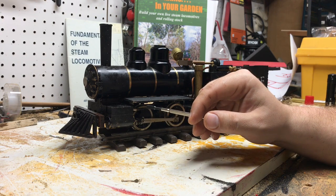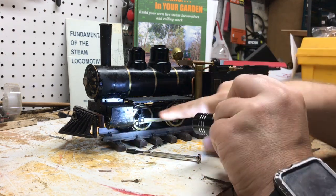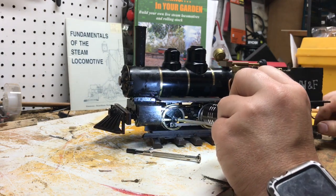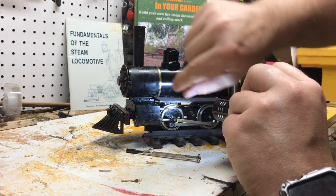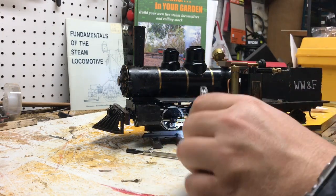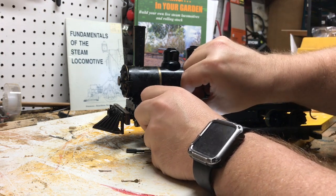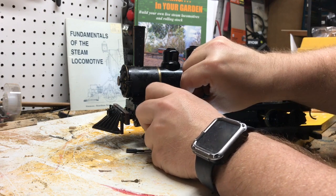So I checked out the timing, and the other side was fine. This side needed a little bit of an adjustment, so we're actually going to go to bottom dead center. I'm sorry if you can't see that on the camera. And that mark could go in just a little bit. And then we'll take our comically small crescent wrench. Just give that the slightest tightening.